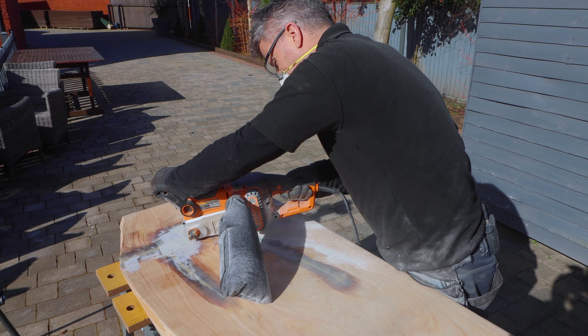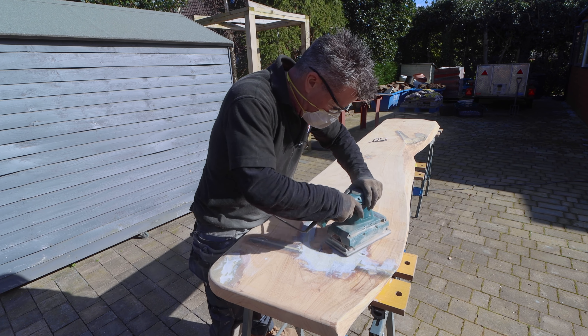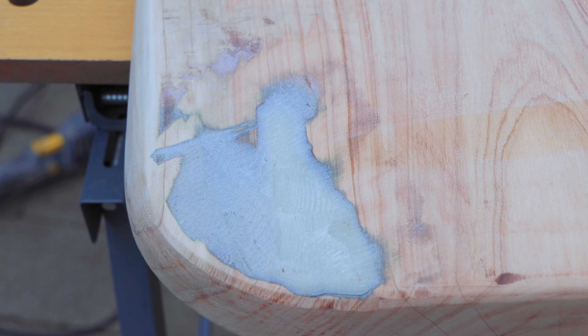I'm going to start by using my belt sander. That'll take off all these heavy lumps of the filler until it takes it closer down to the wood. The next stage, I'll use a more fine sander — just a square or round orbital sander — and this will take it down that little bit closer, making the surface smoother. Do wear safety specs and a dust mask when doing any sanding down. Now, for my second plank, I decided to bring it outside due to the amount of sanding required, and especially when you're using large power tools like belt sanders. Not only did I need to sand down the wood repair, but the main edges of the plank as well.